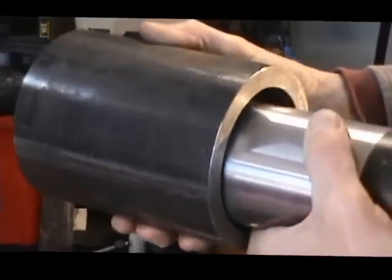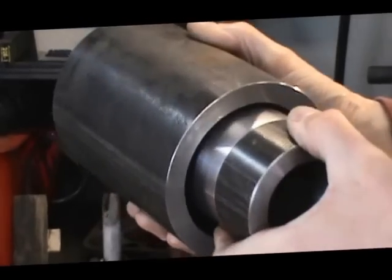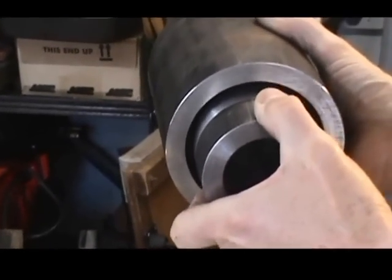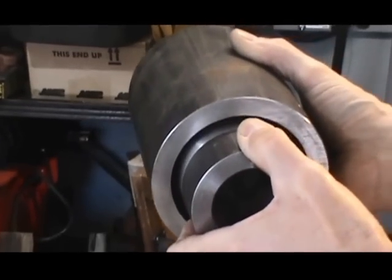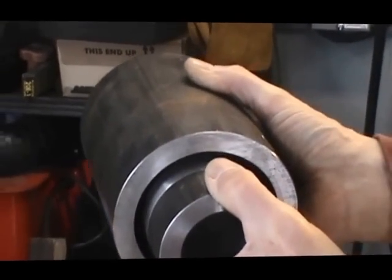It's going to go inside what he's showing you here. Just show him how that's going to go in there. Yep. After the Babbitt is poured, this piece from the dummy bearing is going to ride over the top of our finished bearing, and that void that you see between these two parts right now will be filled up with the Babbitt material. That's how that's going to run.